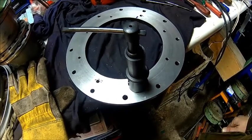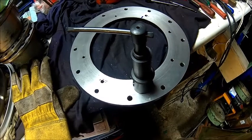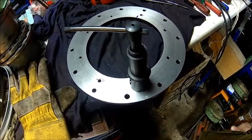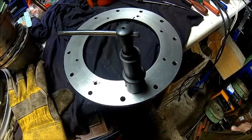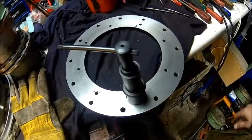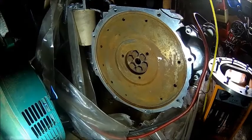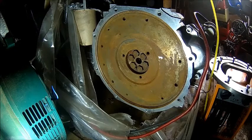The problem is I don't like power tapping with the milling machine because the speed is too high. I tried it once and ripped off a tap — I don't want that anymore. So we'll do it by hand. Three to go and we're done.